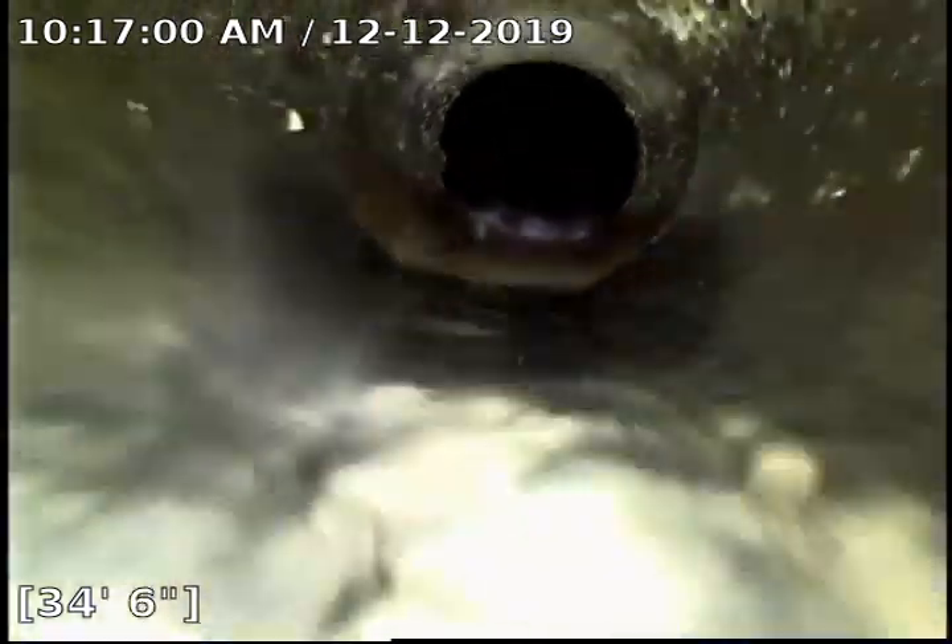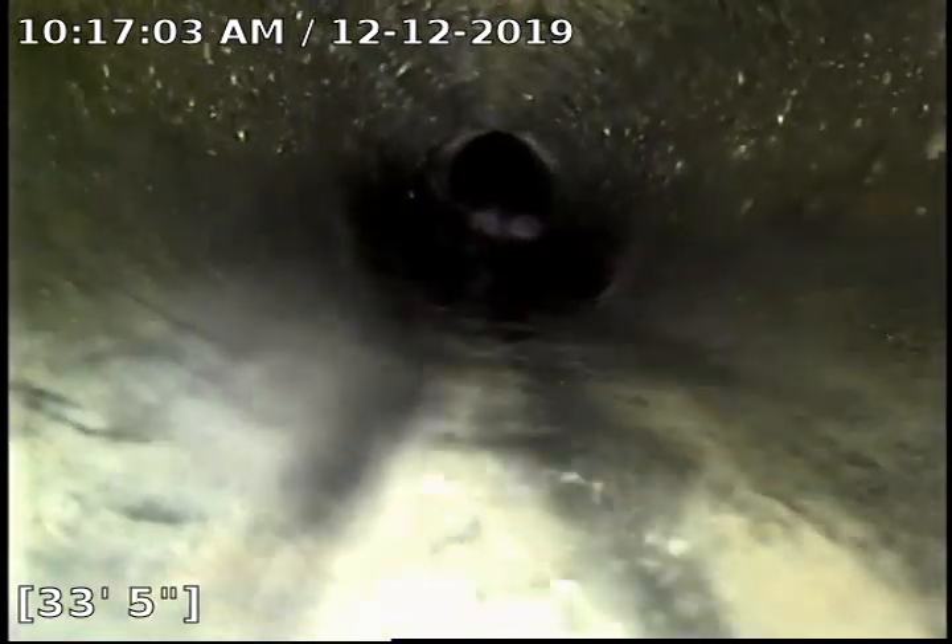We've transitioned — we're transitioning to PVC right now. We're in 3 inch ABS. There's a 4 inch PVC there, and this is where the manhole is where the other unit tied in. We've located this depth at roughly around 2 feet deep. Once we camera the other unit, we'll jump into the manhole and go from the manhole out to the city main. Right now we're at 3 inch ABS as we come back.